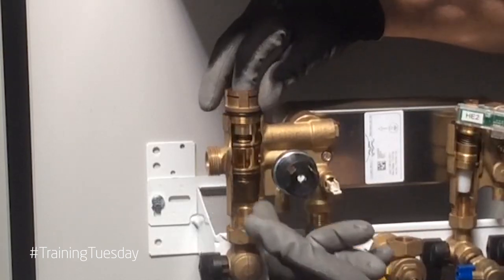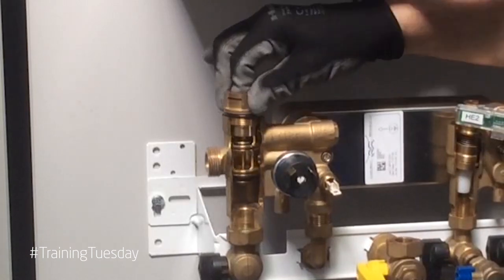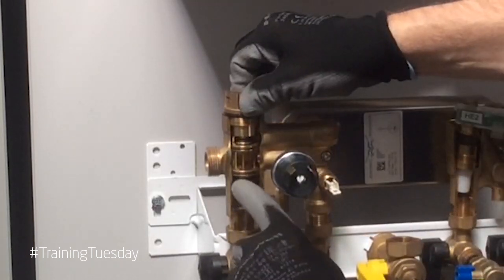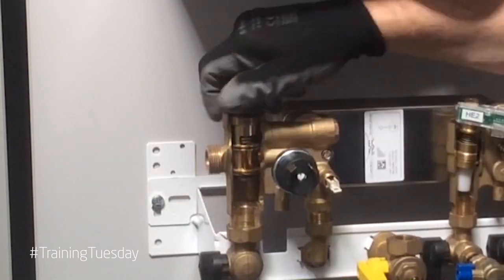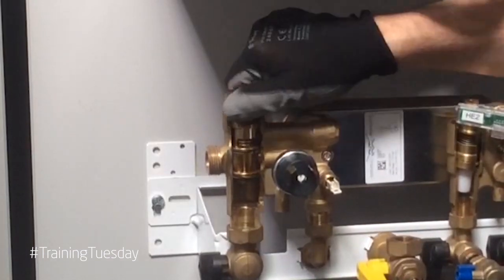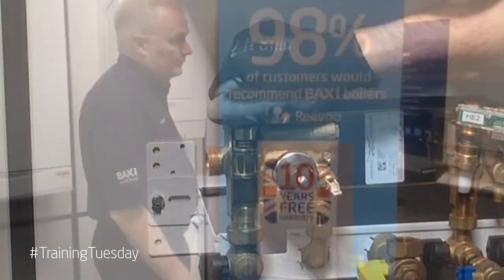So the best thing to do is just push your finger in there — basically you're holding that down and rotating it as you screw it up — to open this valve seat up at the bottom to allow the water through it. Once you get to a point that it equalises the pressure, you'll be able to screw that down until it stops, and then just nip it up with your adjustable spanner.